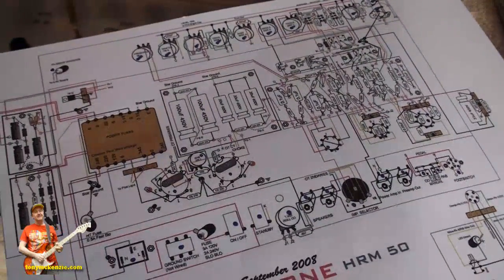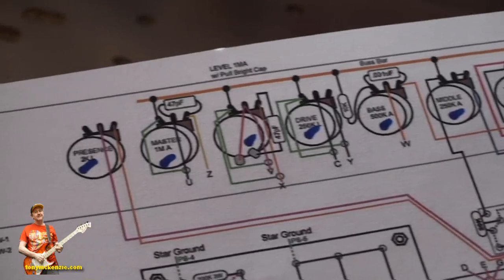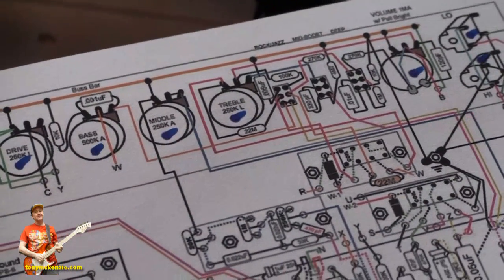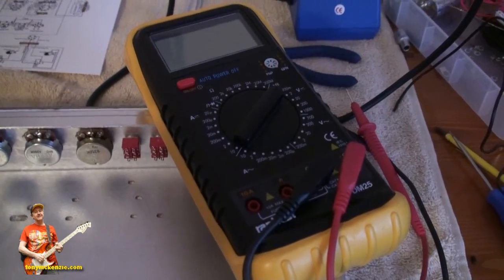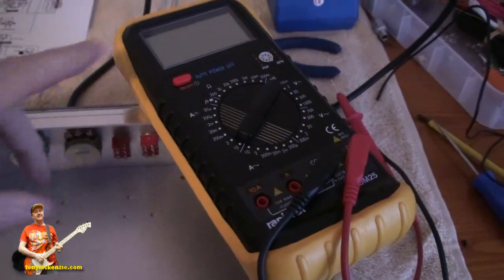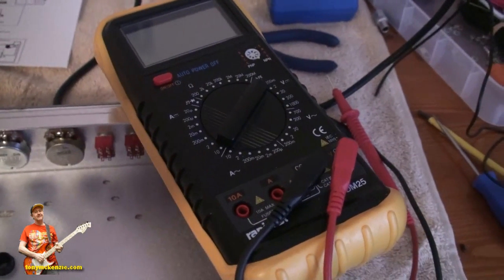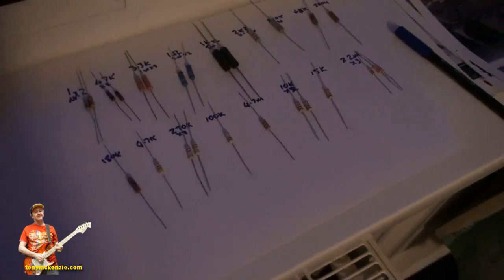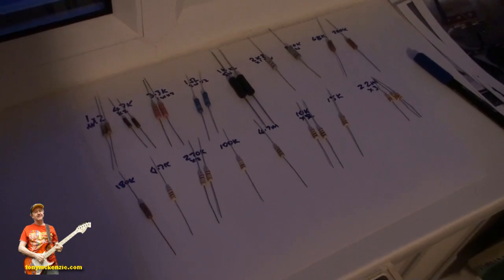One of the things I do is print off a second copy of the diagram sheet. As you can see, there are little blue dots all over the place — they cover everything that's been fitted. As you go further down the road, you just carry on putting your little blue dots on, or maybe red or green, whatever colour you fancy. Here's a quick shot of the type of meter I use — everyday meter. Turn it on, it works. Here's another little tip: I like to lay out all the capacitors and the resistors so you can see what they are straight off the cuff, without having to mess around trying to read them. Spend a bit of time setting them up, then just install them.